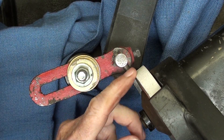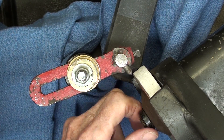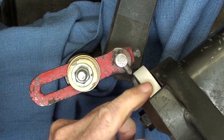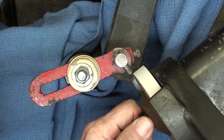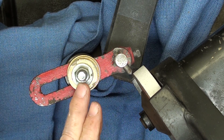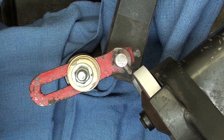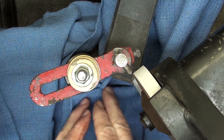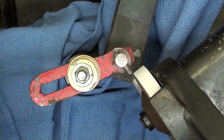I don't think much of that was visible in the video, but you can see the black lines from the Sharpie are gone and it just looks real good. The next thing I'm going to do is remove the dressing unit and get ready for the actual grinding operation. By the way, I don't see any grinding dust at all on the drapes here, so the vacuum cleaner did an exemplary job.